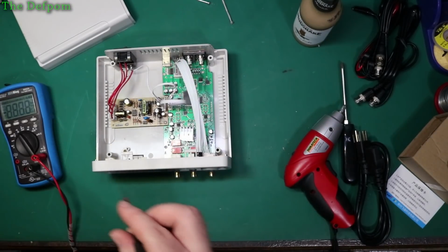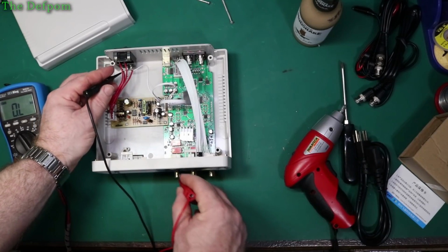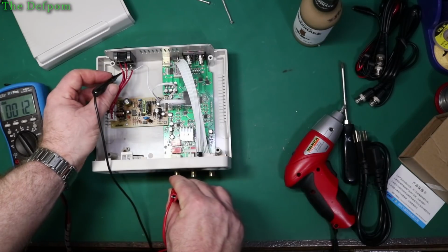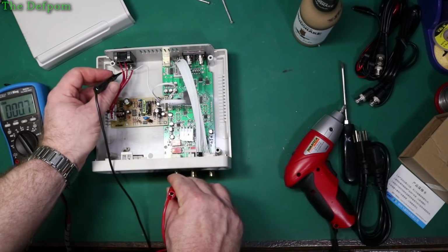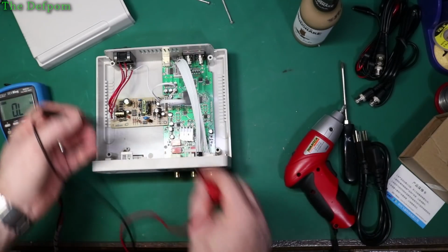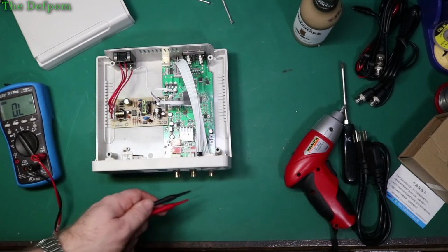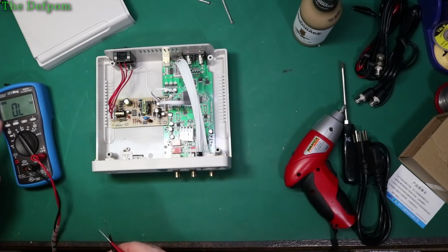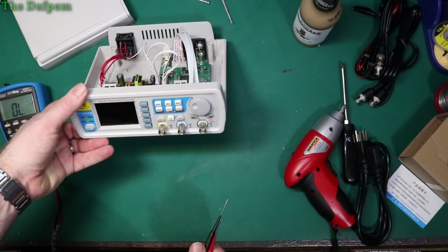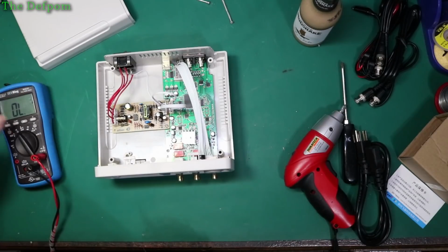Let's have a look. So it's just check resistance from the earth pin. Yeah, it's one of those. No, it's got 2 ohms there, so less than 9. Let's try and get a decent connection. 0.6 or so, yeah, that's alright, because 0.6 is basically what my probes are. Alright, so yeah, straight through. So they are indeed grounded. Must have a secondary cable or something goes through. So those are indeed grounded terminals. Are they grounded to each other? Let's just use the sounder, it's easier. Yep. So it's all grounded to each other. So the switch obviously goes straight to that board there. It's got a little fuse right there. Discrete diode rectifier.